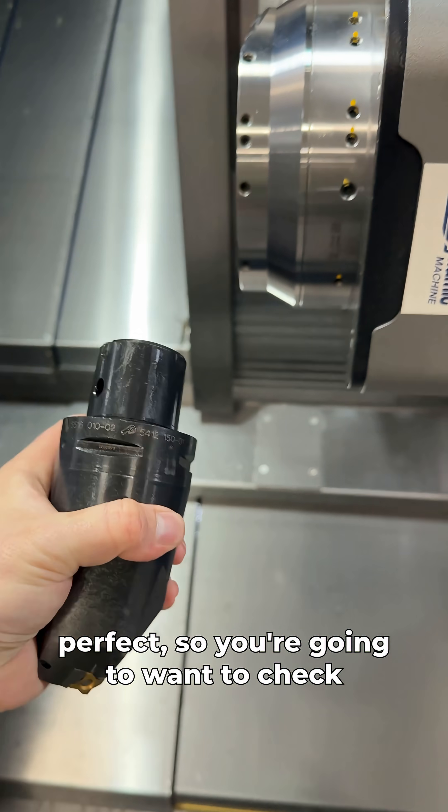We're going to take a skim cut in the J2 orientation, trying to remove 10 more thousandths, which will get us to 2.390. Again, we're going slow here — we're not trying to do this fast. We're trying to see how off-center this tool really is.